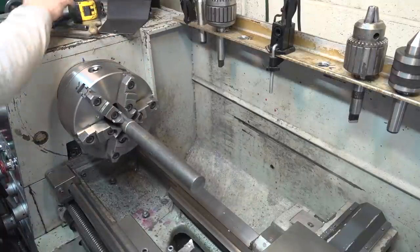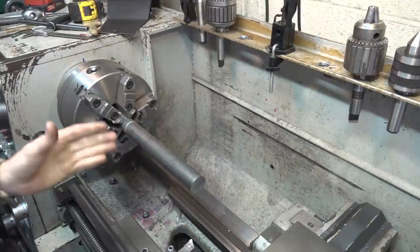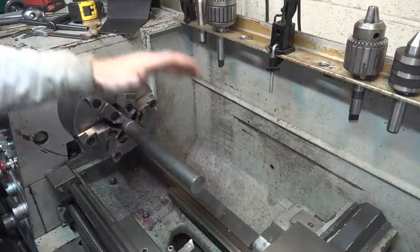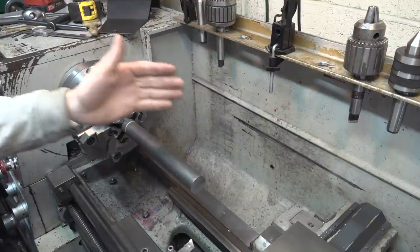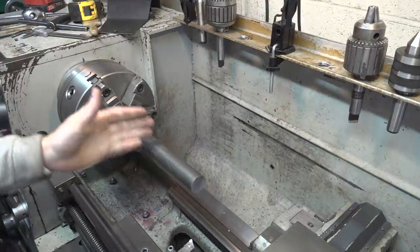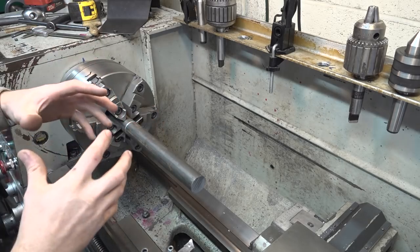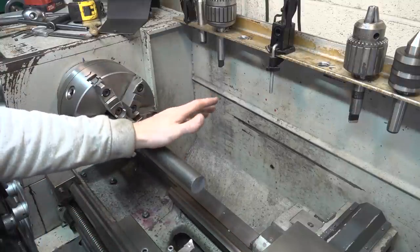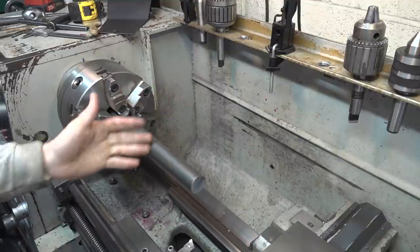All right, so I'm using 1¼-inch hot rolled round stock. I don't really have anything else that's a smaller diameter that would work. Ideally, I should be using cold rolled, but I don't have any of that. I do have a ton of machine steel, which machines beautifully, but it doesn't weld that great. Welds like crap, and the welds on there are kind of brittle, and machine steel isn't really meant for welding. So this hot rolled steel is gonna have to work. It's the strongest stuff that I have in stock right now.